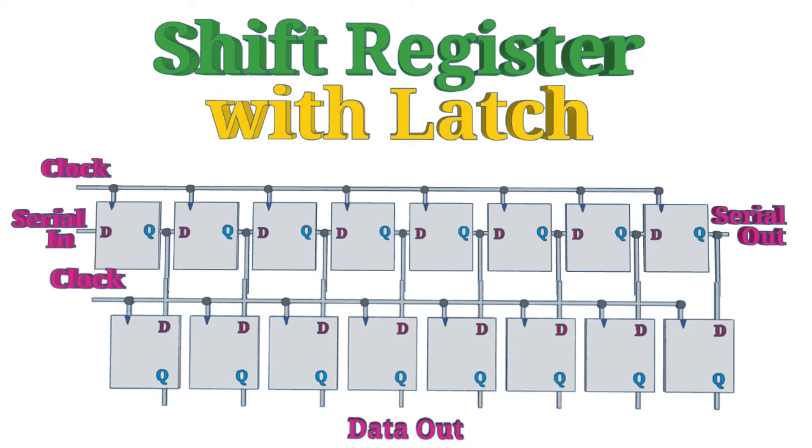This is a fairly crude drawing — I've just overlapped the shift register from the latch from the earlier diagram. This is how circuits are designed, but normally using a circuit design tool or at least a 2D drawing tool. One thing you'll notice is that there are two different clocks. These are separate clocks: the first may be known as the serial clock, and the second stage would be the latch clock, or otherwise known as the register clock. The latch clock would only pulse when all 8 bits are shifted in, so it would run at one-eighth the speed of the serial clock.